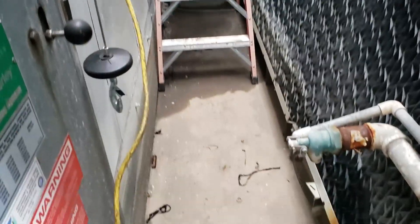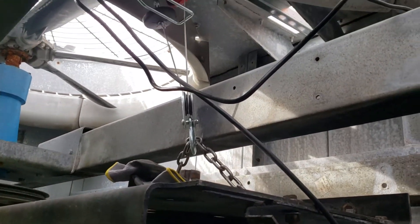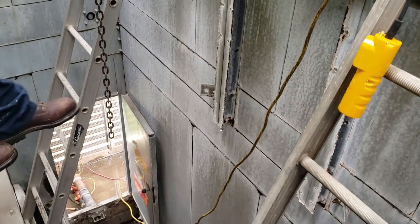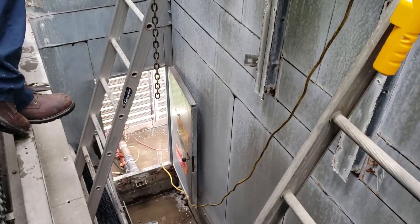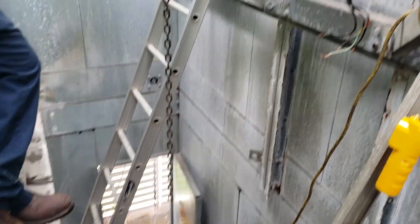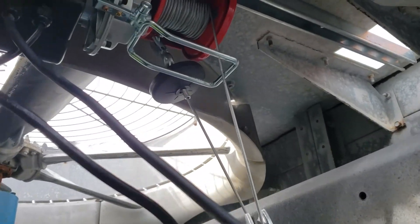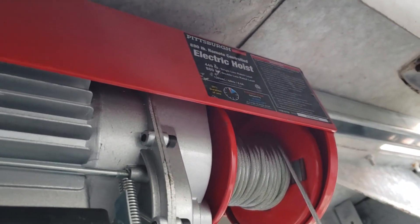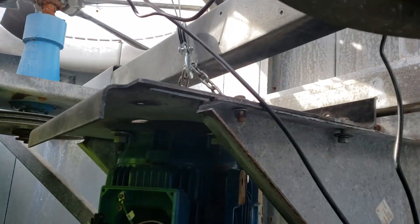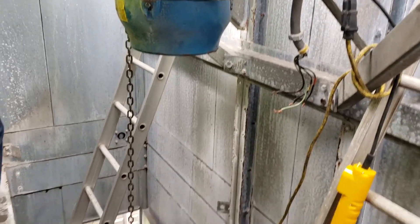Here's my little contraption — here's the winch. I have a pulley over here deflecting the lifting point. So you're glad to have this thing up there and bolted in place? A little scary — it was a little sketchy. But it went easier than expected; it actually worked out pretty easily. It's just knowing that we're trusting ratchet straps and things like that. I was worried about that thin wire. It says it's 440 pounds, and then we halved it, so each half of the wire is only doing about 200-something pounds, but still — watching and hearing it creak always makes you nervous. I always stand as far away as I can.